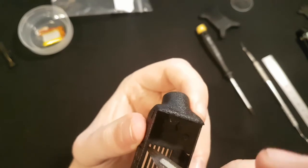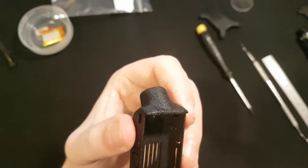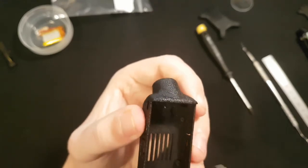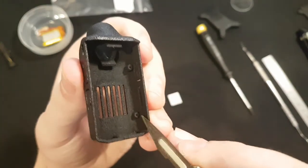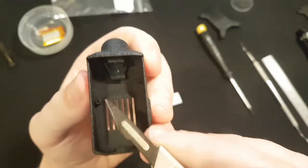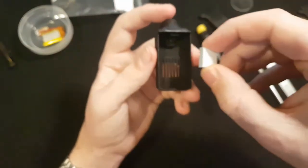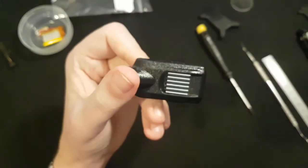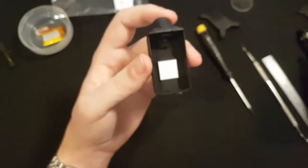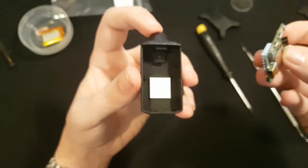What I do is just quickly give those a little ream around the top edge just to make sure there's not going to be anything there. Try not to remove too much material because these are pretty well sized for the screws — you just want to make sure none of that loose powder is in there. Then you're going to take that heat sink and push it into its position. This is how you make sure that the heat sink aligns perfectly when you put the board in.